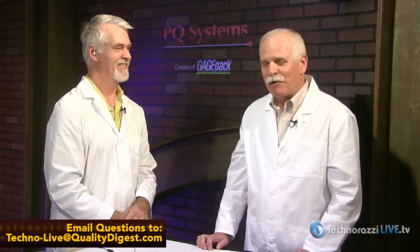And I guess the question on this was, can you actually calibrate this? Now this thing costs like what, $6? It costs $6 to buy and $7 to ship, and it would be about $300 to calibrate the whole thing. So it's cost prohibitive, but let's answer the viewer's question. He said, how do you calibrate it? And that might be the tool he's using to accept the product. And the ISO specifications say if you're going to accept a product, that tool has to be calibrated. So he has to calibrate that tool.